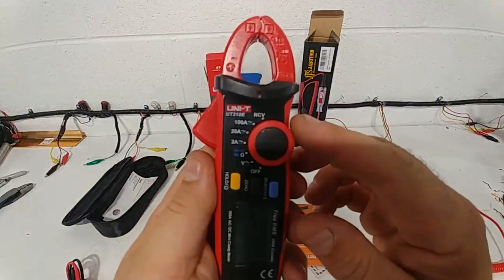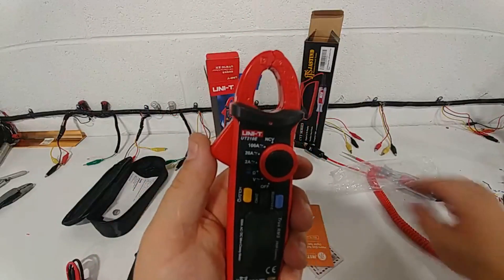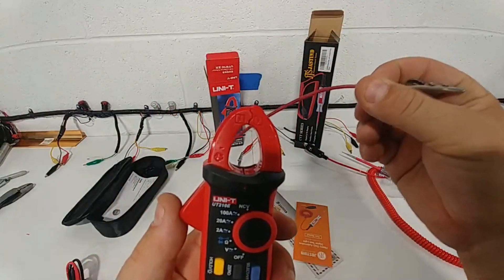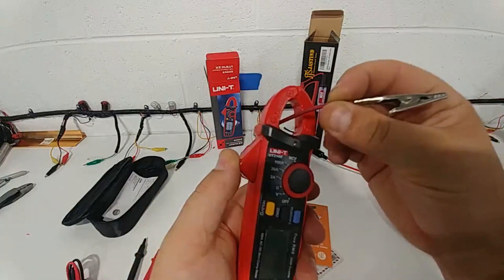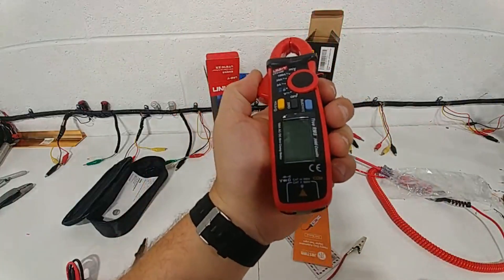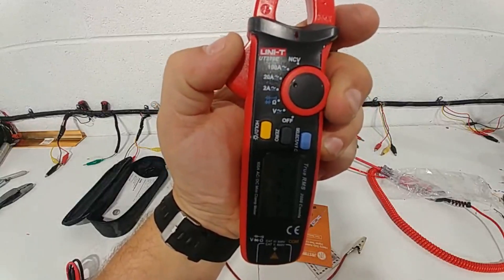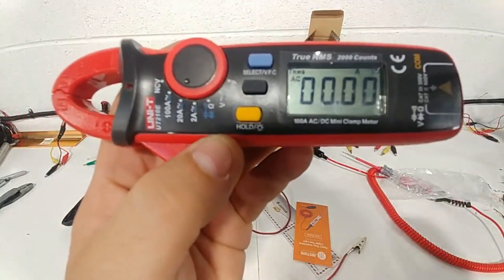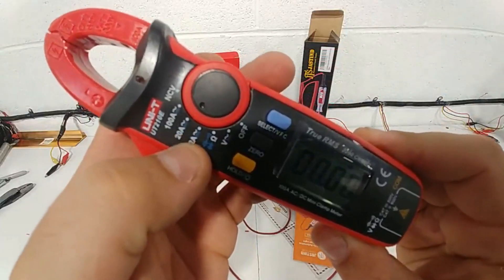I like this one because it is a clamp-on induction ammeter, meaning when you want to know how much current is going through this wire — 10 amps, 100 amps — you can clip over it and check the current running through the wire. I use this on every single build I ever do. I set it up and the first thing I'll do is choose whether it's a two amp load or a 20 amp load. I can kind of guesstimate on that. Usually I'm using the 20 amp, unless it's a single light, then we'll go down to two amp.